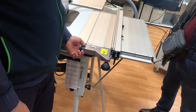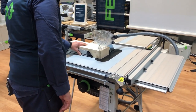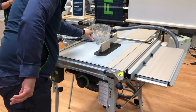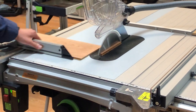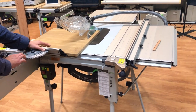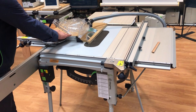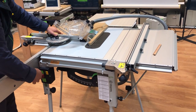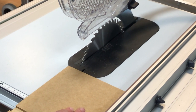Here you can see some cut examples, and the things I noticed most were the great dust collection and the cleanliness of the cuts. Making nice cuts with no tear-out in melamine was also not an issue with this saw. We haven't tried making cuts in big chunks of hardwood, but the 2200-watt motor should handle it with no issues.